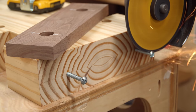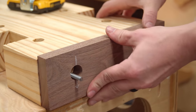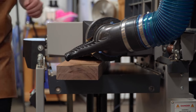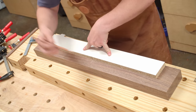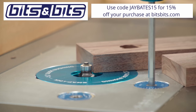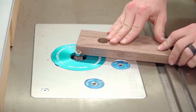The heads of the carriage bolts are cut off and the end stops are installed. The 7/8ths inch hole allows for 5/8ths inch vertical travel with a quarter inch carriage bolt, and this method requires a larger fender washer but is much easier than cutting a slot. The glued up walnut for the front vise is milled to its final size, and the same storyboard is used to locate the screw holes. I should have waited until after the final fit of the end stops and front vise to add the 1/8th inch roundover — I didn't, had to repeat the step, so learn from my wasted time.